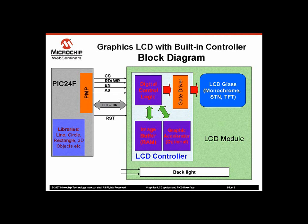All color displays require some kind of backlight for operation. Smaller displays use LED backlight, which simplifies the backlight power supply. Most of the time they use more than one LED. If they use multiple LEDs in series, then you may need a higher voltage for backlight. If multiple LEDs are connected in parallel, then you will need a lower voltage for backlight.